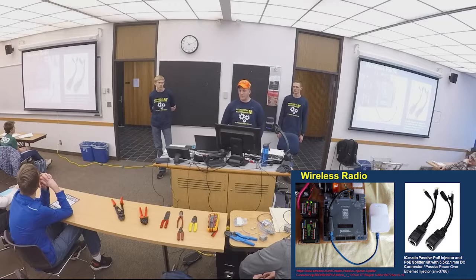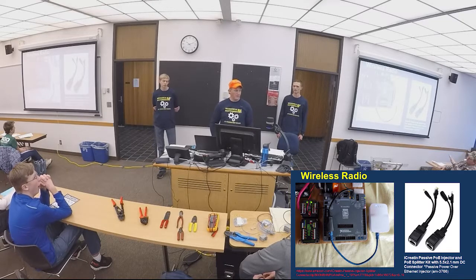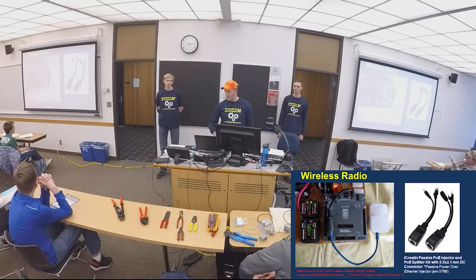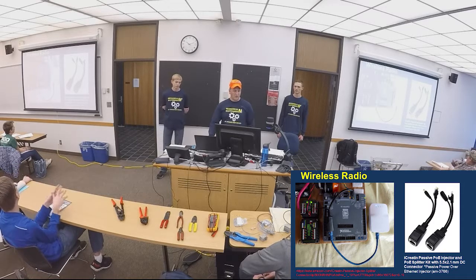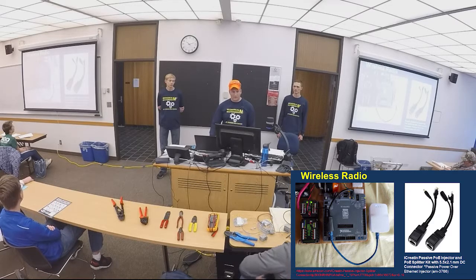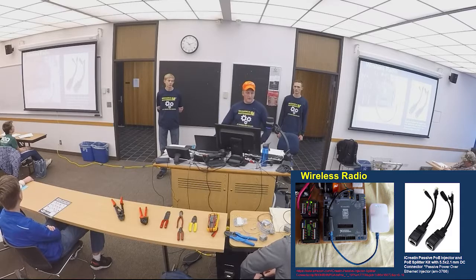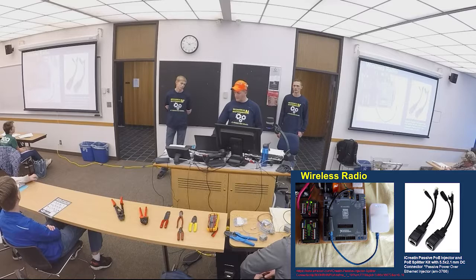We get them off of Amazon. You can buy 2 of these and a very good quality of them for about the same price you can buy 1 on AndyMark. But you can buy them wherever you want. But buy a good quality one. And make sure they have the 2 wires on there for the power and stuff, not just one that can break. So again, that will go right to your voltage regulator, and then your Ethernet plugs right into your radio there. You see the blue cable goes right in there, and that provides your power to your radio, and the other end goes to your roboRIO.